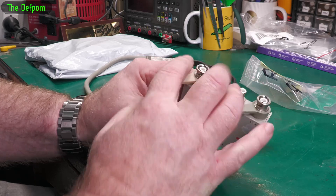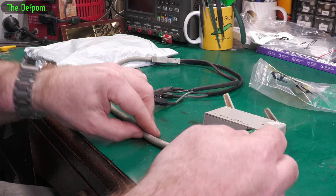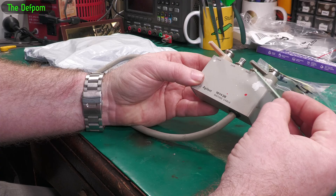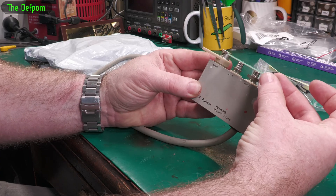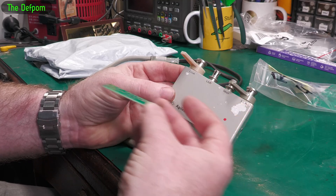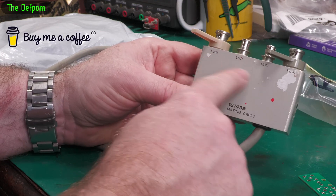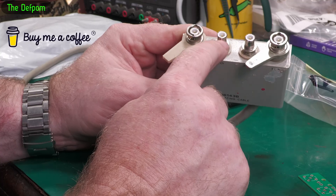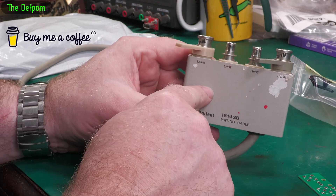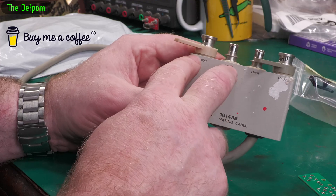As you can see it's quite chunky and bulky, and if you've got a lot of protrusion from your shelving, it's going to be in the way — big thick cable. So Ian didn't like this on his unit, so he's designed this little PCB to replace three of the sockets. The reason it's doing three not four is that the fourth one is superfluous. This is low current low potential, but inside these are actually linked together — this and this are the same thing, even on the actual meter itself, on the 4338B. They're linked together; it's the same potential, so you don't actually need two connections.